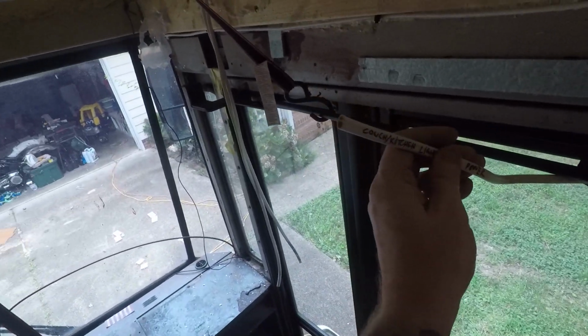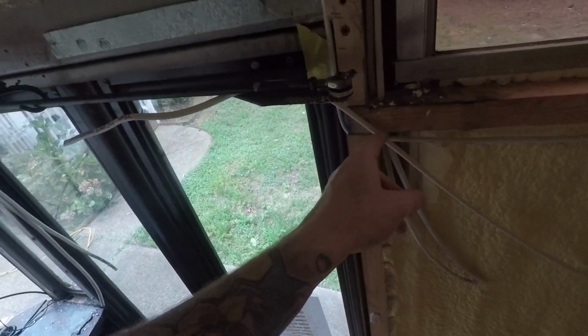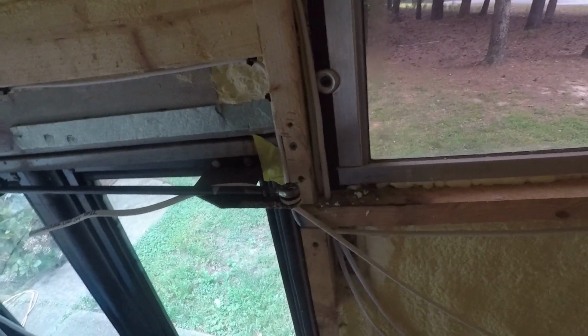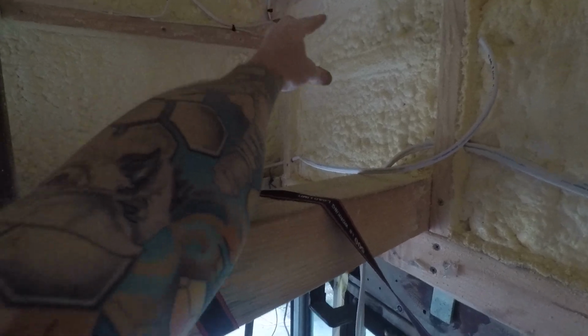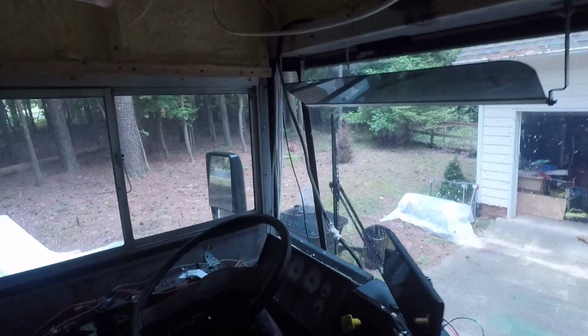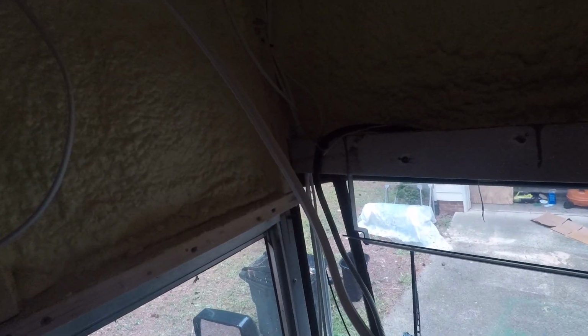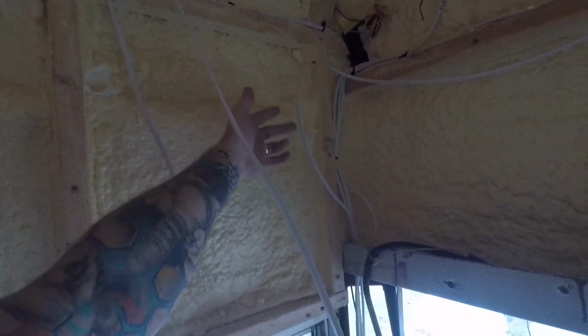So this cable, for example, is coming all the way back from the battery, from the fuse box. It's gonna be meeting here in a light switch. Then out of it, I'm going back to the lights in the ceiling. And then I'm also extending the power out here so it goes to the outside light and the camera. And then from there, I'm also daisy chaining in parallel, connecting power that goes all around above the windshield to this side, where I'm gonna have a switch for a light that's above the loft here, above the driver area. And as well, I'm also daisy chaining, connecting in parallel the power that's gonna go to the camera that's gonna be on this side. So it's gonna be close to the switch for the lights. I'm gonna tap into that power.